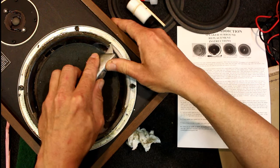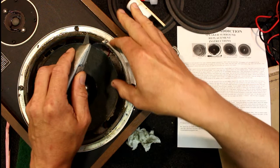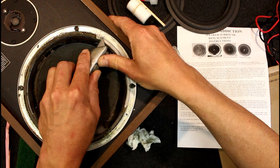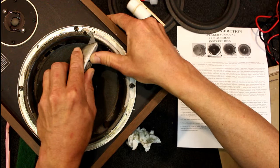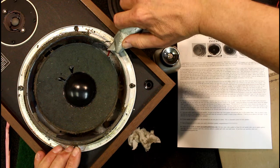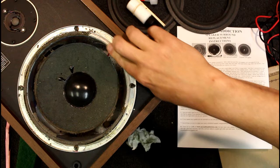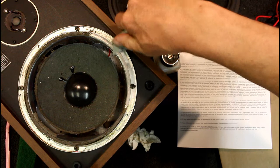Just keeping going around with this knife and removing the glue on the inner. Most of it's come off on the outer. The outer stuff's not so important if you're going to put a new gasket on there — you could just glue over that. Pull any flaky bits off but stuff that's well stuck down — since the gasket is just decorative if it's poking forward like this, it's pretty unlikely to cause any problems peeling off. Even with all the vibration of the speaker and stuff, I doubt it would ever come off again as long as the old glue's well and truly stuck down itself.